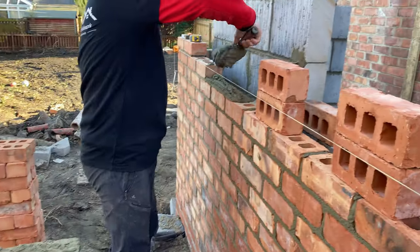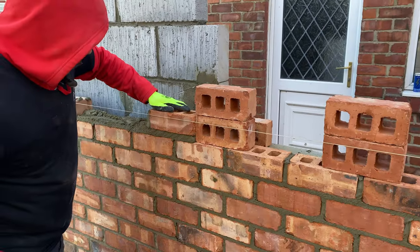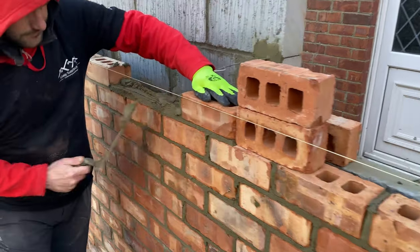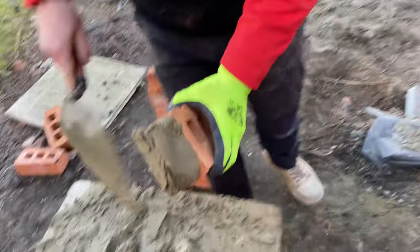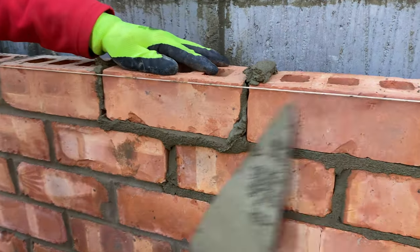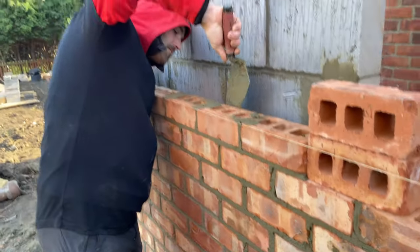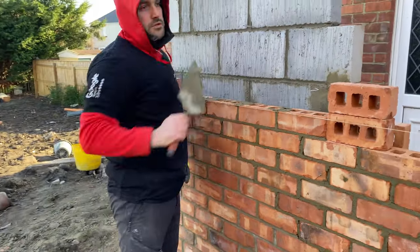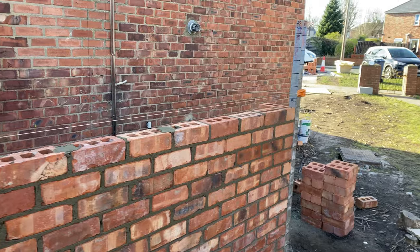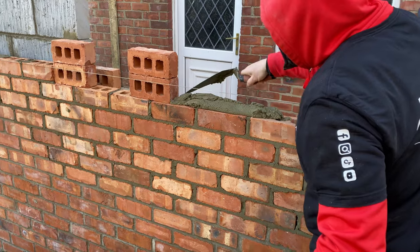Let's go. We've just set the windows, so I'm just going to pull this little bit of brickwork through here now. We'll just lay that up against there where we've just marked our measurement at. One window set there. So what we do now, we go to the other end and we'll start to pull our brickwork from that end now up to this point here, and then that way we can move our perps to suit if they need to be opened up or whatever.